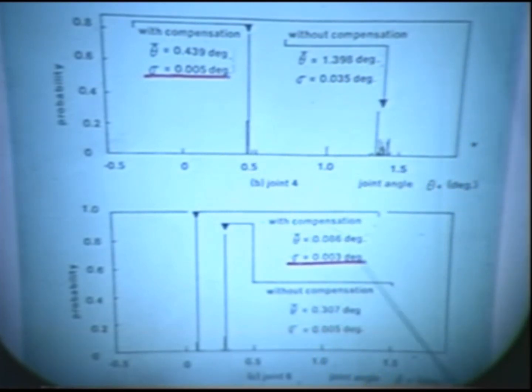The reason this direct drive arm has such good repeatability is that the direct drive joint does not contain any uncertain factors such as friction at the gears or deflection of the steel belt or chain. So it shows very good repeatability.